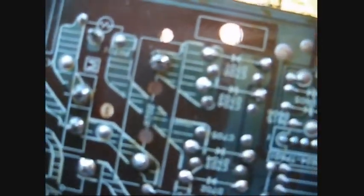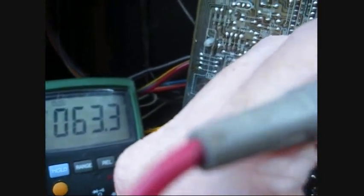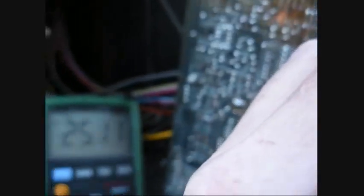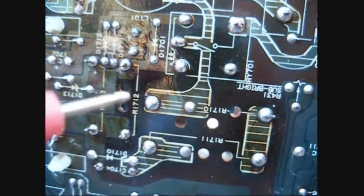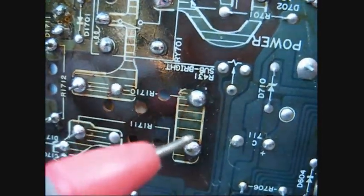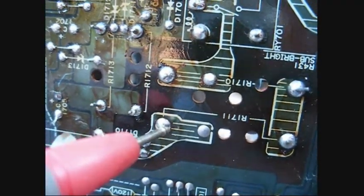It's not going to do anything. So now what? We're plugged in. Meter connected — let's see what we have on the plus side of this capacitor that I think is the standby filter. We have 63 volts, so we have something there. On the relay coil we have 25 volts — that seems good. We have our 120 volts AC coming in to the input of this resistor, and then it goes down through to another resistor, and at the other end of this second series resistor we have 93 volts AC.